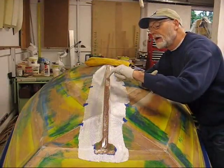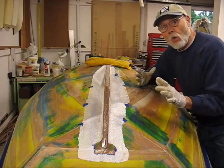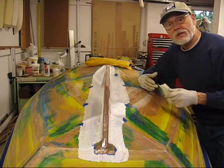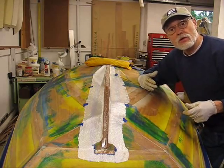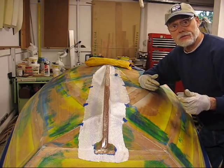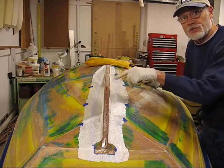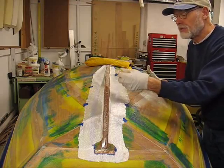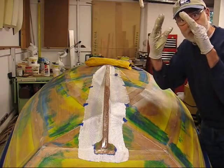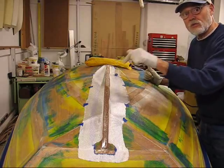I've got the center wetted out and then a little bit on the ends. I'm going to walk away from it now and let it go green. I've got a little bit left in the cup — I'll butter up a couple of pieces for another clamp, which I'm going to cover in the next two or three episodes. We'll come back when this is greened out and nice and stuck in place, so that when I'm fooling around with the brush on the side it's not going to mess this up, make it poof up, and be hollow underneath. I want that adhered tight to the wood.